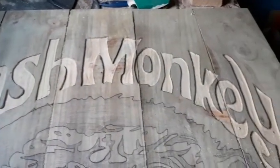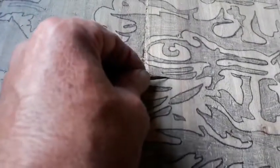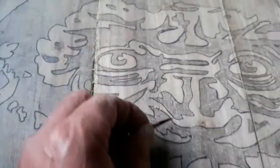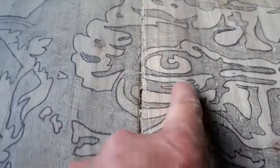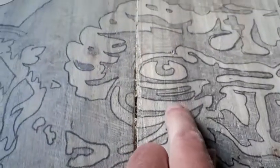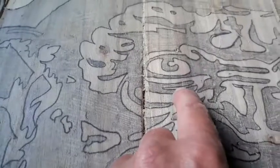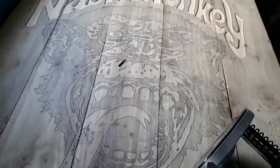Right, we've got the easiest bit done. Now I'm going to change the router bit and go for this little pointed one. What I think I'm going to do is basically draw all around these bits with this, and then put on the one we had before. Hopefully as I come in with the wood, as it reaches the bit I've gone around, it should just pop out. I've got little concerns about this bit here - going in with a big router bit, that bit's going to pop out in the middle. So to play safe, I'm basically going to draw around it all with this pointed one, and that section should pop out without damaging the bit in between. I've already got it on my router and I'm ready to go.